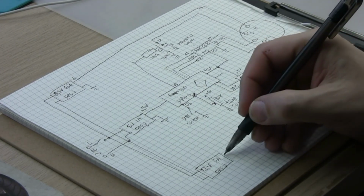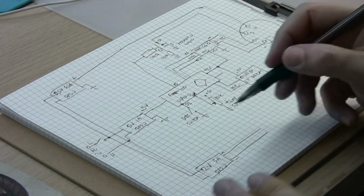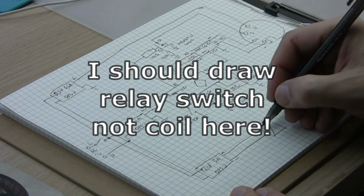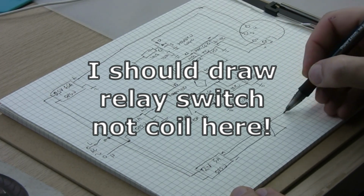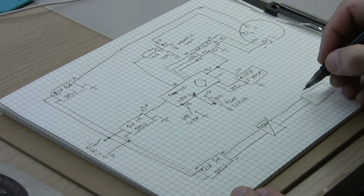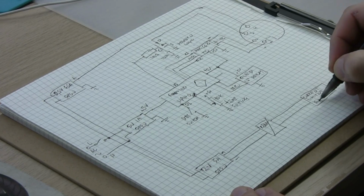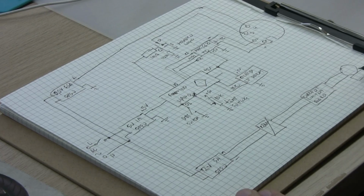And then finally we have a circuit for the pump. Here there is no plus minus. Here this ground is not connected and not common with the other two. This goes to the relay. So that's the relay. From the relay there is another board here that is a current limiting board, and this is connected to the vacuum pump motor. So that's the vacuum pump.